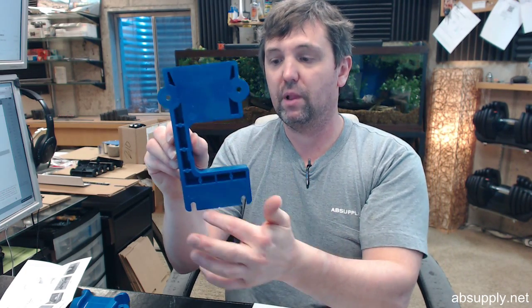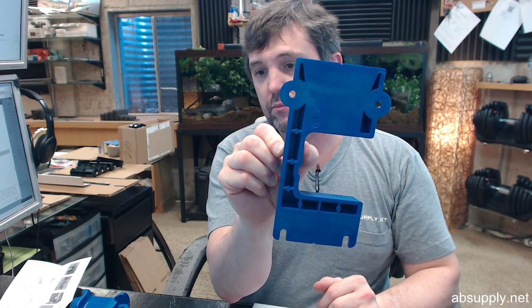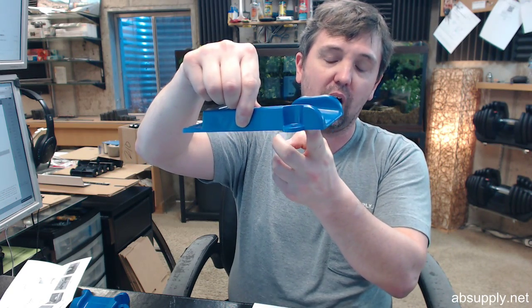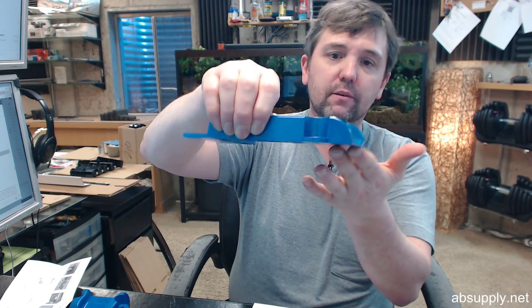Apply your 1/8 of an inch silicone bead. I suppose if you were a belt and suspenders kind of person, you might use the adhesive anyway, even if you were doing the thumb screw installation. So apply your silicone. Put the tape on if you want. I probably would not. I don't want anything that's going to increase your margin height. I wouldn't want anything getting trapped underneath there. I'd probably want to silicone that and let it sit down.